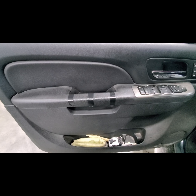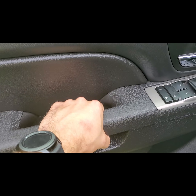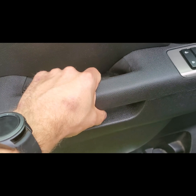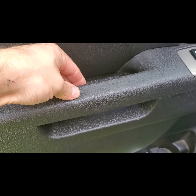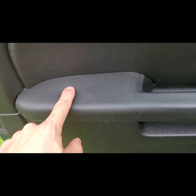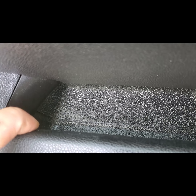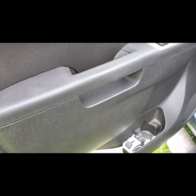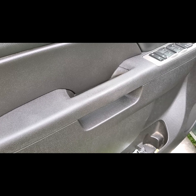It looks pretty good. I've got the tape on to secure it, making sure there are no bulges — everything looks nice and straight. After 24 hours I'll come back and see if everything is hard and test it out. Overall I'm very satisfied. The handle is twice as sturdy as it was before. I'll give it another 48 hours before I really pull on it hard, but after 24 hours it's already quite firm. The urethane got in here and back here — it looks really nice. I think this is a good fix. If I had to do it over, I'd just wear gloves and tape it up a little nicer with some paint masking tape. Thanks for watching — hope it works for you too!